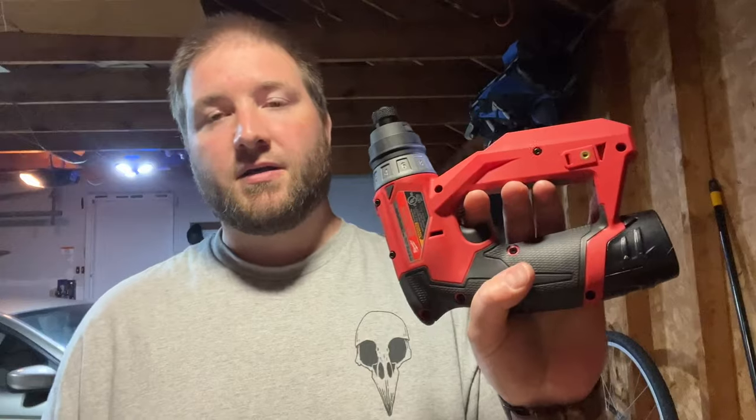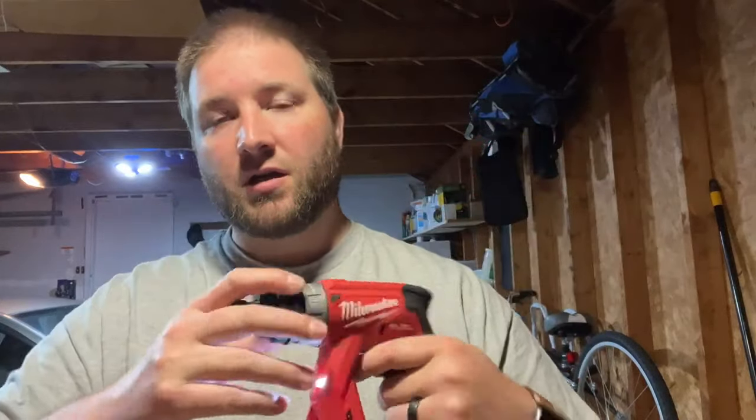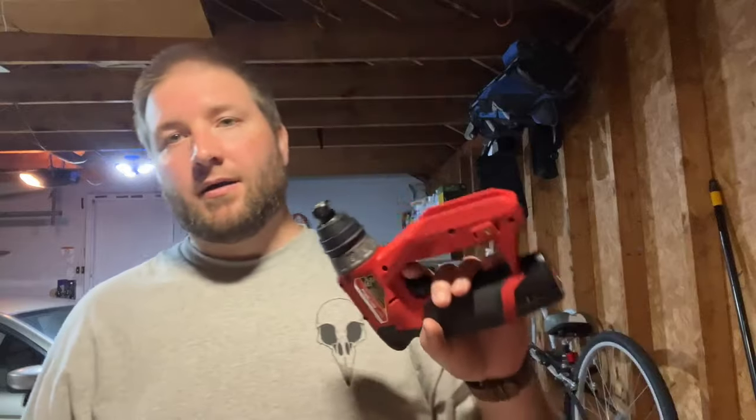And then I got the installation driver because I wanted something that had the offset chuck, the right angle chuck, and I wanted something I could hand my wife when she's putting together IKEA furniture. Nobody wants to do it with the Allen keys. Those suck. But make sure you get hex or metric hex bits, because if you use the standard bits with IKEA furniture, you're gonna strip all the screws. I've made that mistake. Or the other way around, whatever.